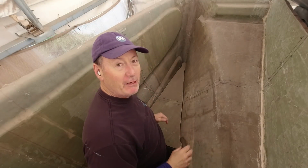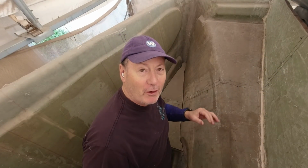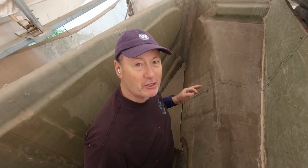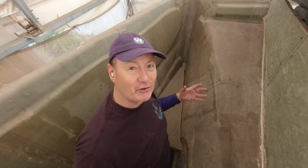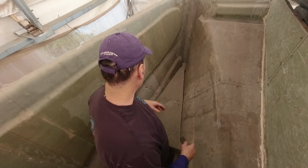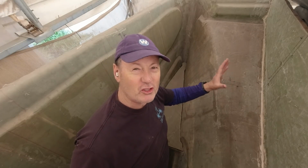To basically prepare all the surfaces for tabbing. This bulkhead here is 20 mil foam, 300, 600, 300, 600. It's an engineered structure to serve as a main crash bulkhead. And essentially the bulkhead here is the same underneath, but the one that passes here is actually a secondary structural member as well up in the bow. Very, very strong construction. This all is going to have to be sanded and prepared. It is peel plied, so it's just dusty.